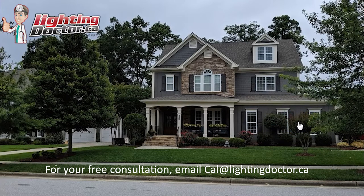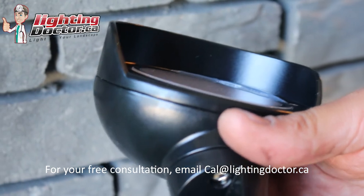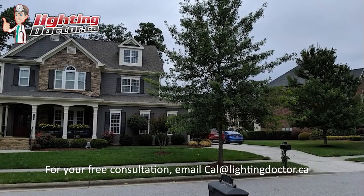Something I would highly recommend to make this really stand out is lighting the second tier of the house using a wash light, which has a wider angle and a softer spread. I would mount those on the second tier using a gutter mount — it basically just screws to the gutter and the fixture screws into that. I'd get one on this side covering most of it, one on this tier getting the peak. Running wire up the gutter and making waterproof connections there is actually quite simple to do.